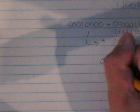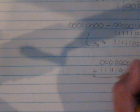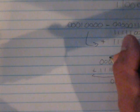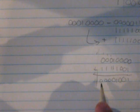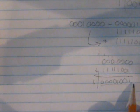Let's actually add these two bit by bit and see if we get 9, since 16 minus 7 equals 9. Adding 00010000 plus 11111001, working through each bit with carry-overs, we get 8 bits of result with a 9th bit carryover of 1. This is interesting — our ALU can only output 8 bits, so even though there really is a carryover of 1, we actually have an output of 9, which is 16 minus 7. That's basically what the 2's complement does so you can perform subtraction on an ALU.